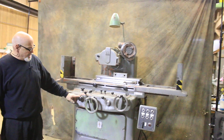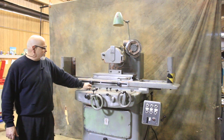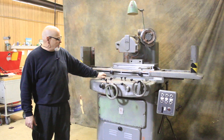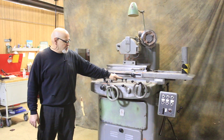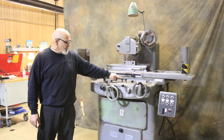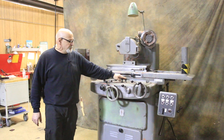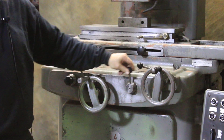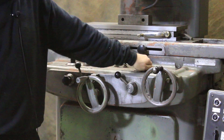The amount of step for the cross is adjusted here. The speed of your table is adjusted here. Here you can turn off the table. This here is lubrication for the cross slide, and this is lubrication for the table ways. Over here starts and stops your cross slide, and this is in or out.